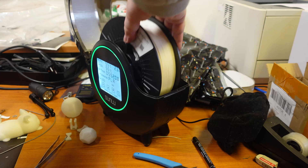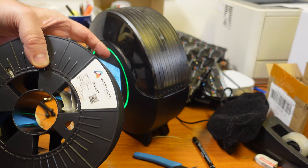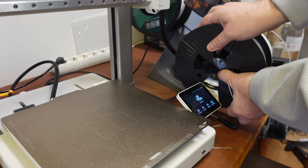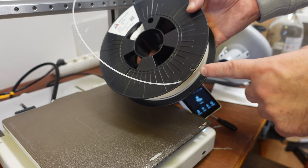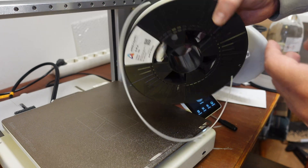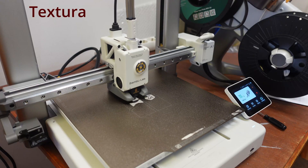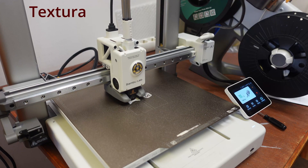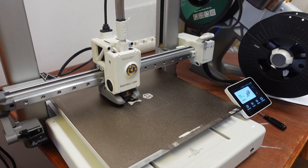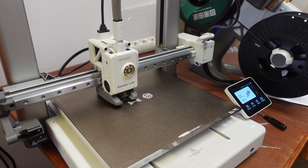The Textura was in the filament dryer for a few hours, but unfortunately it's not so easy to print from the dryer connected to the A1, so I will print it from open air. Only on this one position we have the holes for locking the end of the filament — they should add several more. The start is good and this filament is less transparent compared to the previous E-PLA, but I also noticed the smell is a little bit stronger, so I have to open the window, and we'll see later if there is more stringing.